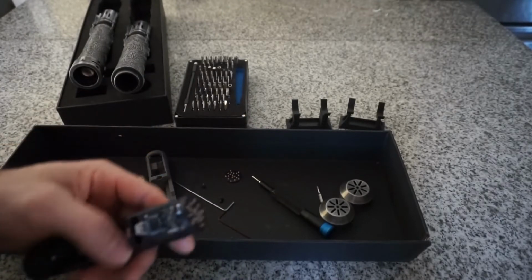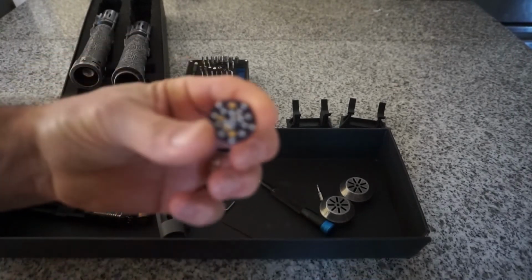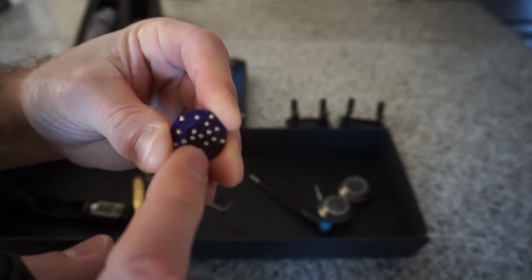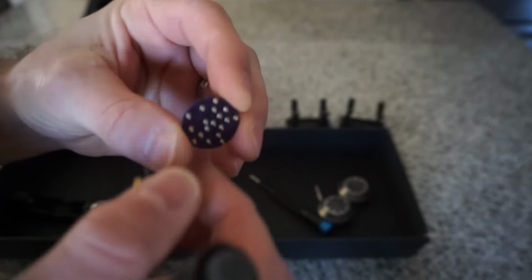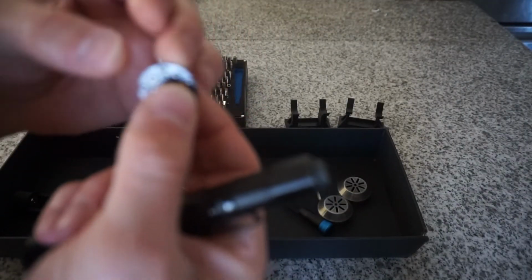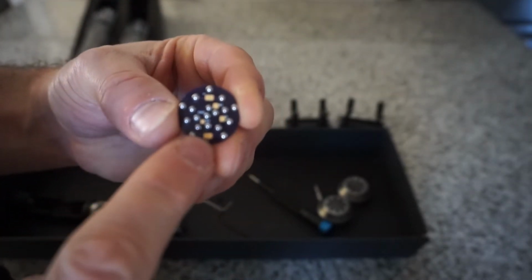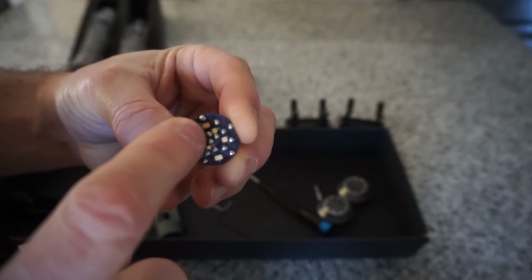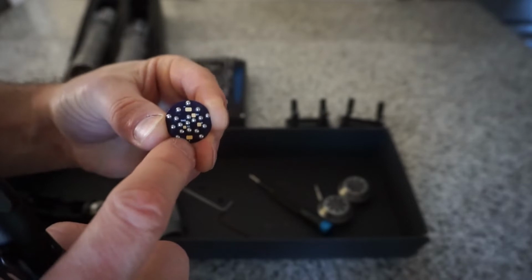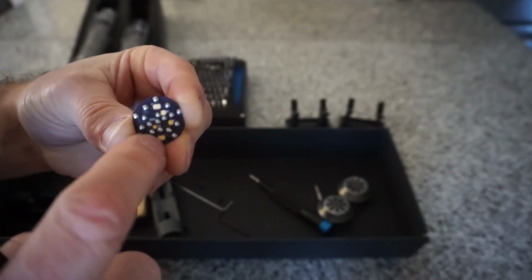And then wire this up, right? So this is your other PCB, I'll call this the hilt side. Again, it'll come with the pogo pins already installed, 3mm pogo pins. So what I do, hopefully you can see that, you have a bat positive pad and a bat negative pad, right? Those are for NeoPixel. So the 22 gauge wire that I ran from the bat positive terminal, that'll go right there.